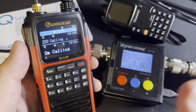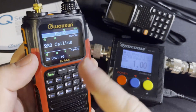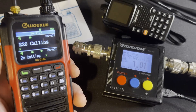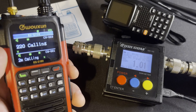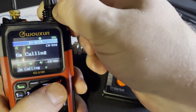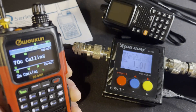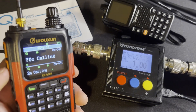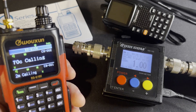Back to the SWR test — on 220 (1-1/4 meters) at ultra-high, we're getting 1.12 watts. Again, not super high, nowhere near the 6-watt maximum, but it does give you the capability to do 220 and hit a repeater in your area. Now bumping over to 70 centimeters — there it is, 5.79 watts. So that's essentially our 6-watt rating right there. 70 centimeters gives us that capability at maximum transmit.